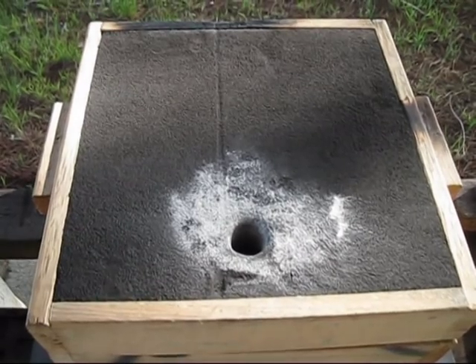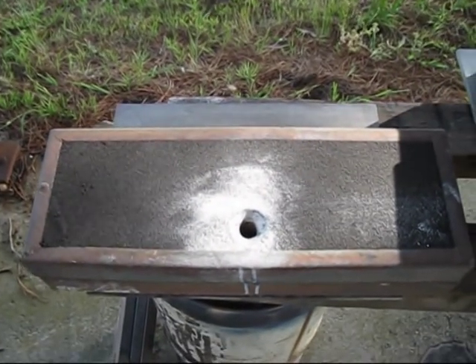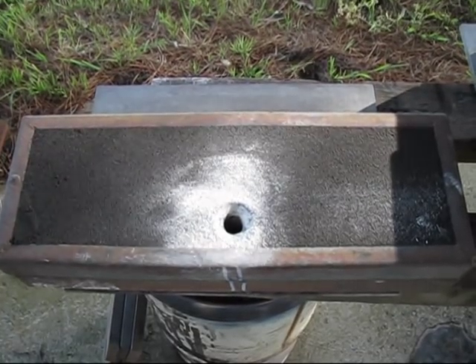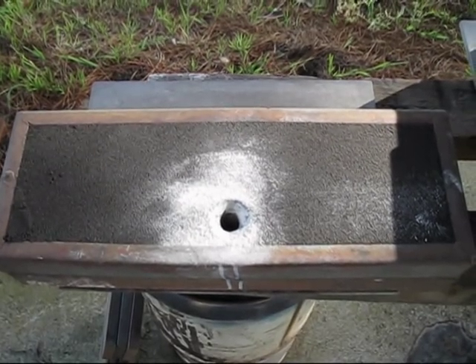There is the angle plate mould — no vents. We'll see if it fills up. And then we've got the smaller mould here — there are no vents whatsoever, we'll see if that fills up as well. That could be more difficult because it is the last dregs of what's left in the crucible and it is viscous.